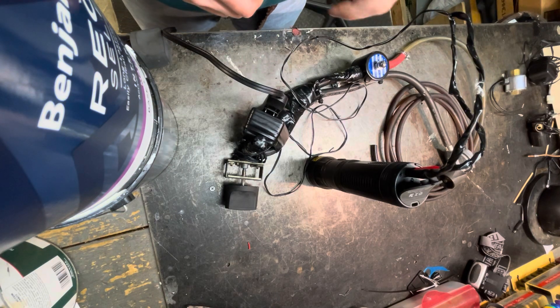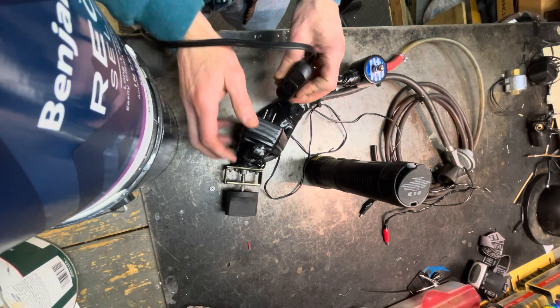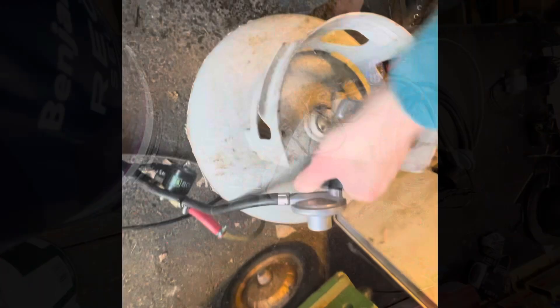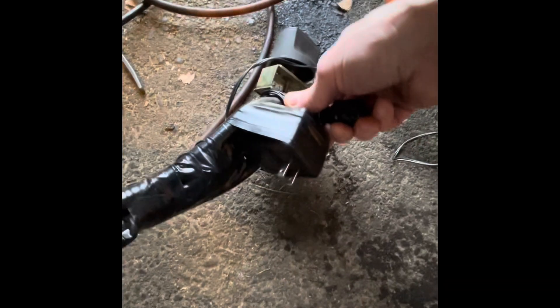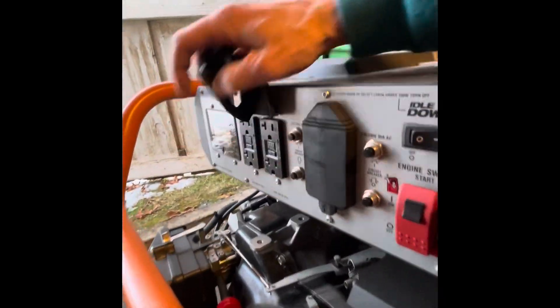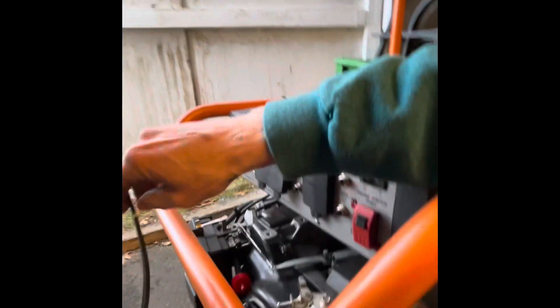Then you start it, and once it's running, disconnect it from the 12 volts. This 12-volt solenoid gas shutoff works off of 12 volts. I have this little low-power transformer here, and you plug any extension cord into that — that way you don't have that big block hanging out. I made it so you just plug in an extension cord there, and then plug the extension cord in here.